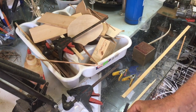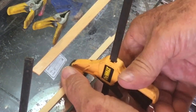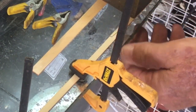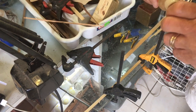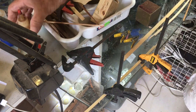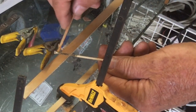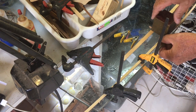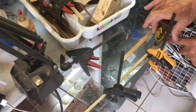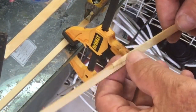Now to join the pieces, we simply clamp them to — I like to use glass because it's easy to get stuff off of it. Mix a small amount of fiber and epoxy. You could put it on both sides; I choose to put it on one side. Make sure it stays flat. I clamp this side down, and I like to clamp both sides of the joint. This is what you're going to end up with, which we'll just sand and clean up.